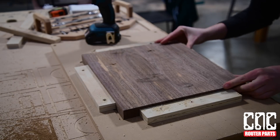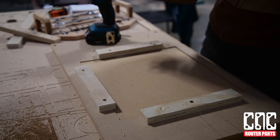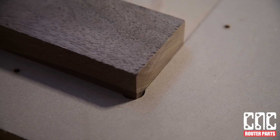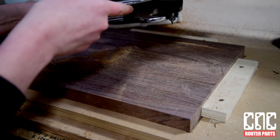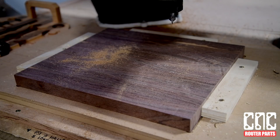As you can see, it's fairly tight. Also notice that I added dog bone fillets to the pocket to ensure that the corner was cleared out for the material to fit and not be limited by the radius of the router bit. Now that our material is temporarily secured, we can run our drilling toolpath with our 90-degree V-bit.